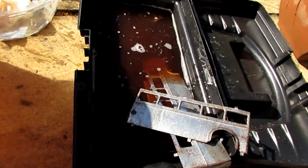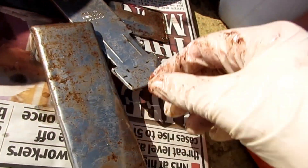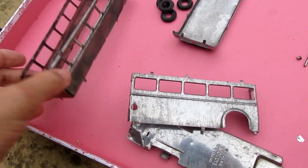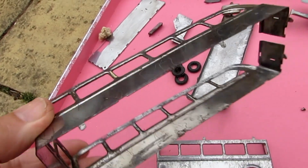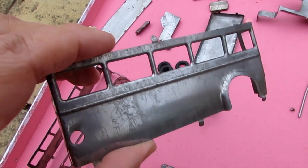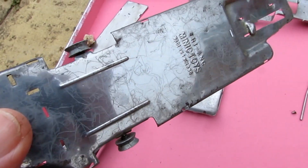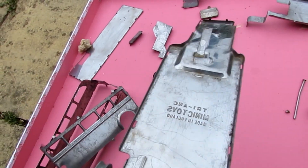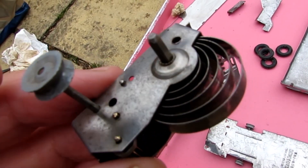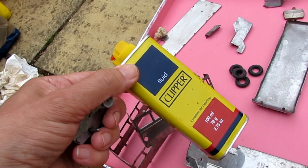Overnight in the vinegar. Looks like the rust comes off quite easily now. I've had a lot of messing about with the vinegar and Brasso and other things, but it's come out pretty well. All those little lines were lines of rust underneath the paint, but they've all come out. Lots of treatment on that, on the motor — it's working beautifully now.